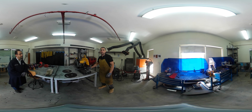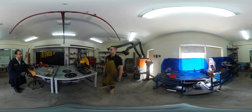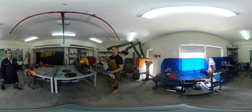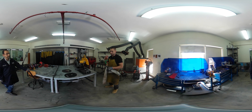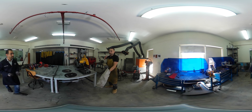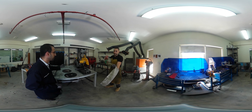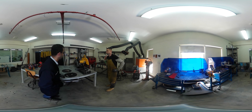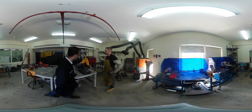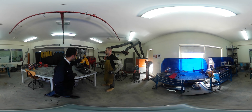Once we have finished cutting off the sample, we will go over to the grinding wheel and prepare it. Now we need to make sure all exposed skin is covered with flame-free clothing, because this will generate a lot of sparks and heat. Regarding starting the grinder — this is a very high power motor, so when you first pull the trigger there will be a bit of a kick backwards. It is always best to keep it some distance away from the material, pull the trigger, let the disc get up to speed, and then gradually bring it down.